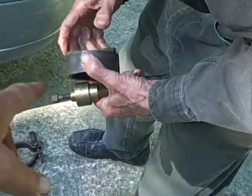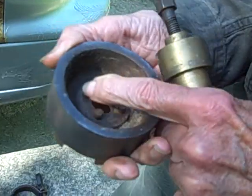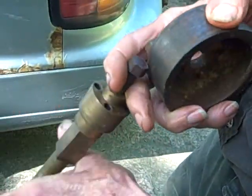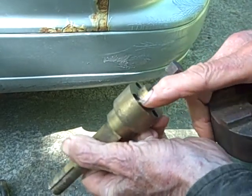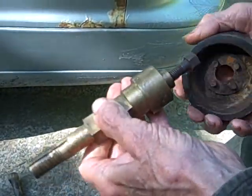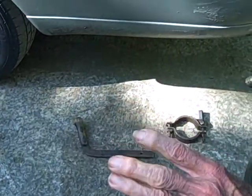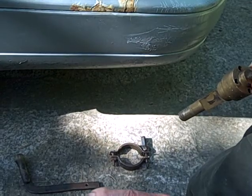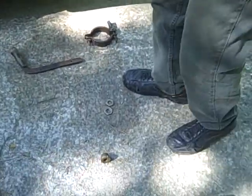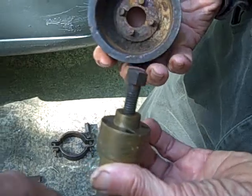I should actually remove that so you can see why it's machined. So the rock shaft — you can see that there are pins located here, and those pins are at 90 degree angles. However, the holes that those pins go into on this rock shaft are at very interesting angles, which seem to have nothing to do with anything on the rock shaft. The reason for that is that he designed it so that when the control handle is down, touching the floorboards of the boat, the skeg will be at its lowest position and the propeller shaft will be straight. So it automatically locates the propeller in the run position, and it stays there. That's the location of those four holes relative to the square.